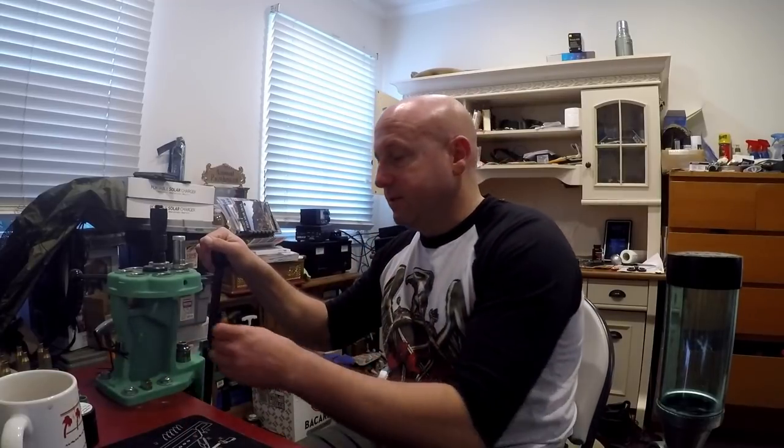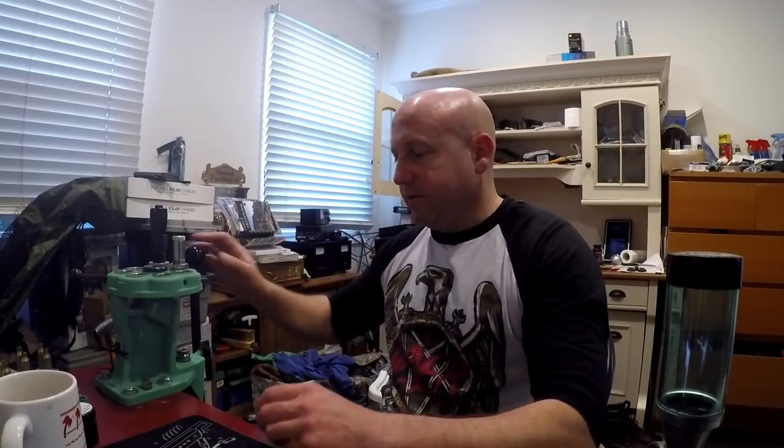So you want to apply the same amount of pressure on each case. Decap, pressure. The amount of pressure that you put on is going to determine how tight that neck is going to be. You want two thousandths neck tension, and the pressure that I put on this in the past has always been about that. So one thousandth, two thousandths, anywhere in between, as long as in your mind and in your feel you do the same thing on every one. That's the ticket.